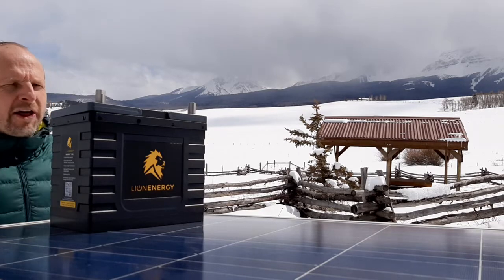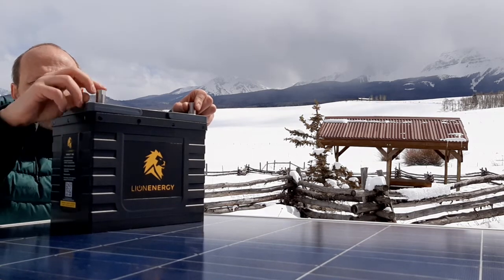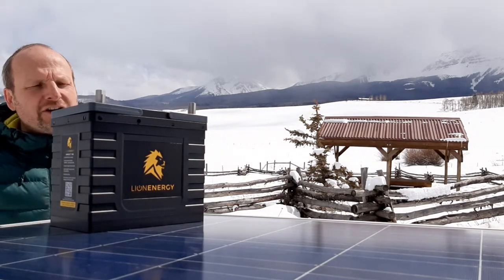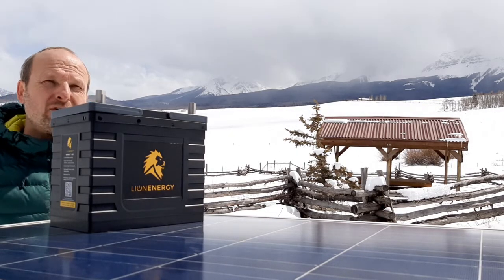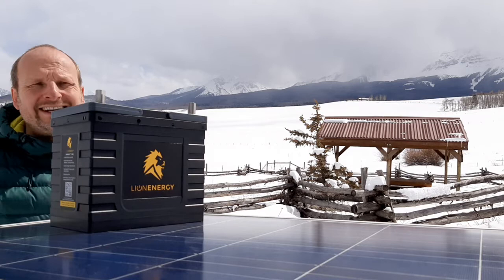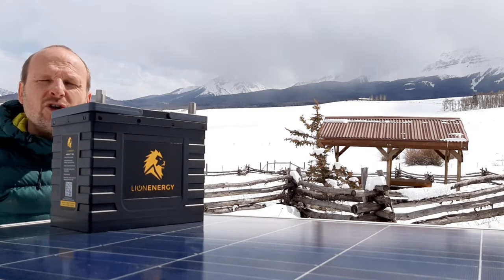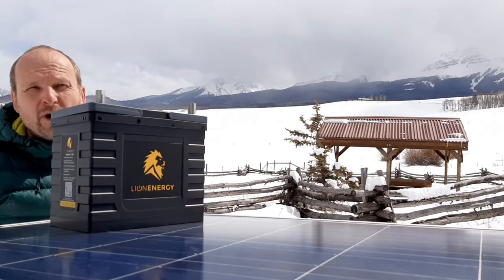There are a few small things we like about this a lot. It's got unique battery terminals — you can put a lug in there and then another one, so there are two places to pull power off, which is nice. It's got nice handles. The size and weight are really nice — the 105 amp hour battery just weighs over 23 pounds. So you can make a super powerful system; even putting four or five batteries in is not heavy like it would be with lead acid. Getting 150 amp continuous discharge out of lead acid batteries takes an enormous amount of weight — this battery is equivalent to about 600 pounds of lead acid batteries if you want to run it for any amount of time.